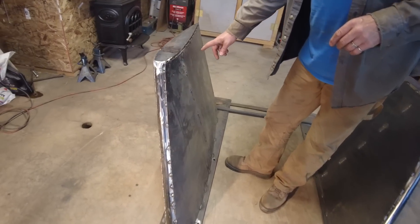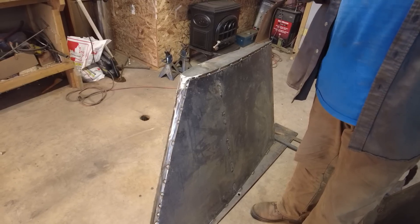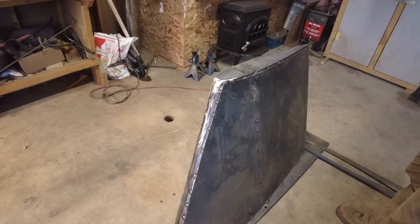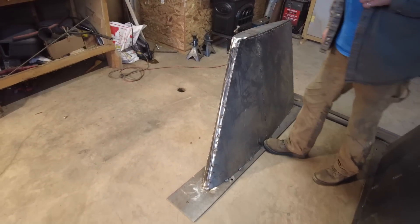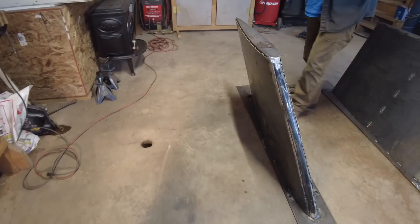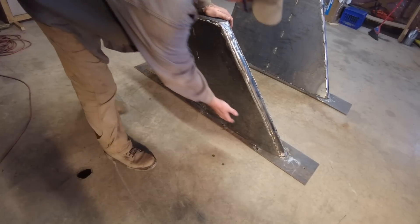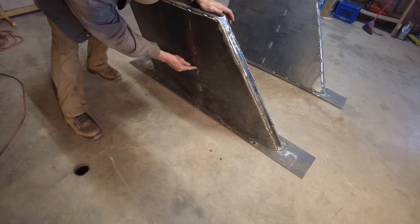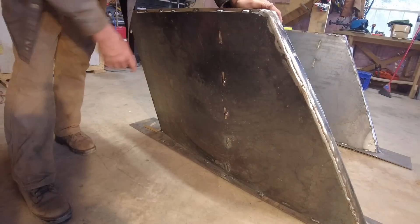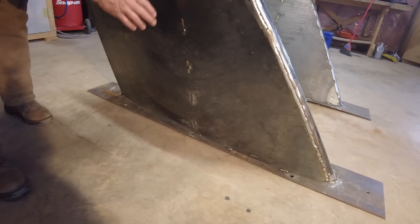One of the plates — the hole that the water jet cut wasn't square. We don't know why, but we'll fix that in the plans. The outer plate is difficult to fit because of the curvature of the bow. Where the bow curves down, it's difficult to get the slots lined up properly because you can't put the plate far enough down — it hits on the front and on the back. What you have to do is bend the front and back in with a weight or a clamp, then tap the plate down until it lines up with the slots.